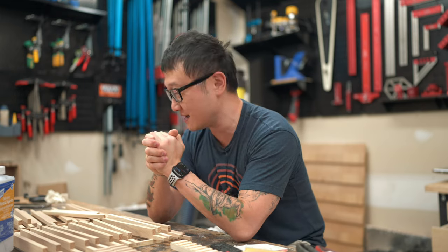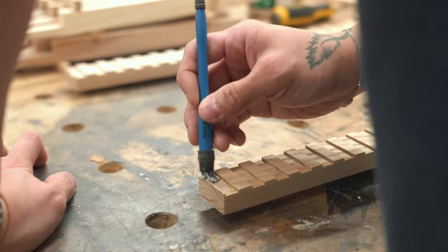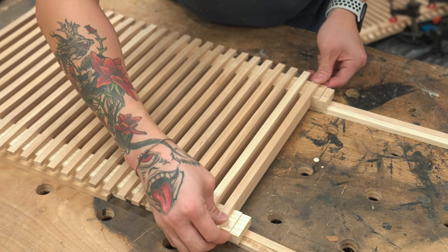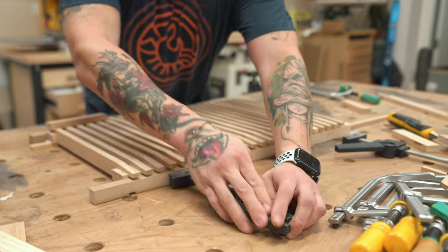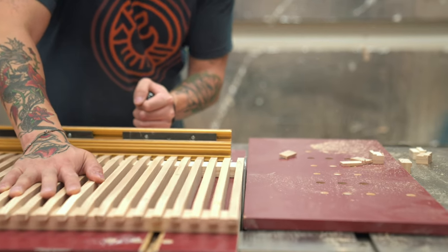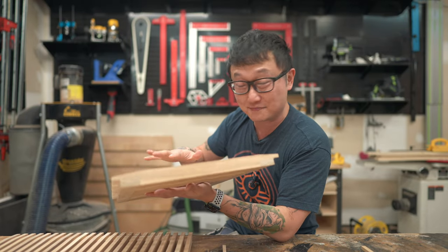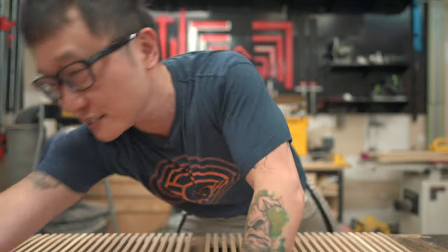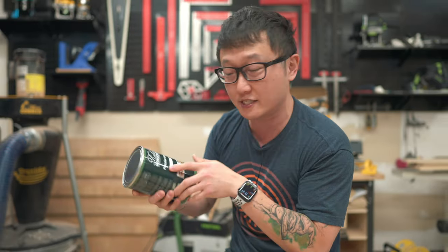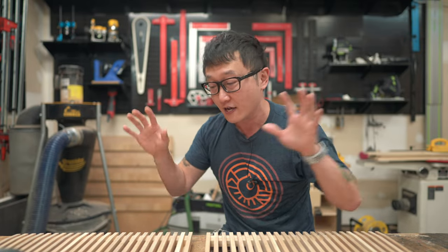Once all the mineral spirits has flashed off, let's get these guys glued up. This came out so good — I've actually never made any slatted parts like this before, and I cannot wait to throw some stain on here. It's going to look gorgeous in black. Just so you know, this Pre-Color Easy stuff is a water-based stain that by itself does not offer any protection for the wood. It just allows us to color it before we apply the finish. But this particular product was formulated so that it doesn't interfere with how the oil finish is going to bond to the wood.